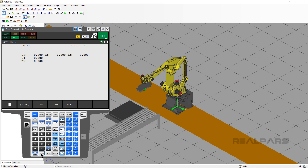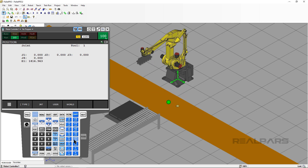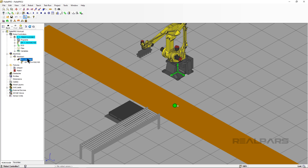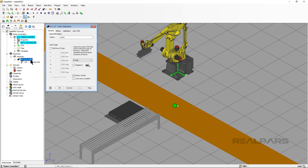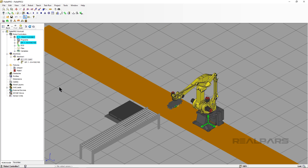Now jog your integrated rail using your last axis. I will use J5 and jog it in the Y positive direction by holding Shift and pressing J5. You may notice that the robot didn't go where I wanted it to, so we must check the Link to make sure we set it up correctly. Double-click on Link 1. Notice that we went with the default, which was Z-axis Direction — change the direction to Y-axis by clicking on the drop-down. Click Apply and then OK. The robot is now on the plane we want it to be on.